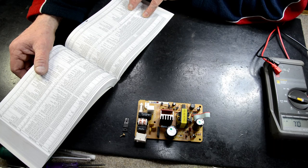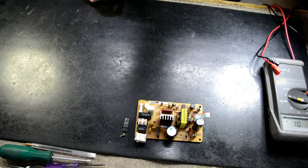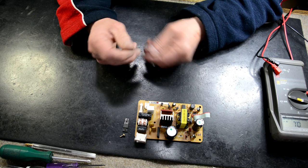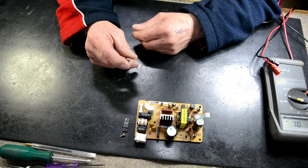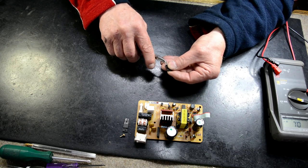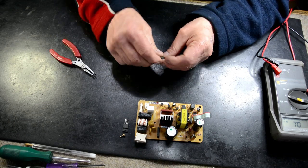Okay, so what we're going to do, now that's shorted, I've got a really heavy duty FET. I bought a pack of 20 of these, 24N60M2s. They're out of the PS4 power supply. So I've got new ones of these. I've looked up the specifications, it's also an N-channel MOSFET, so it's going to kink our leg around the same as that.